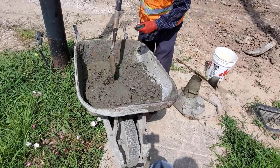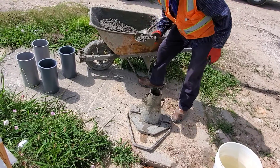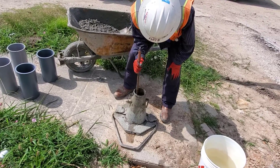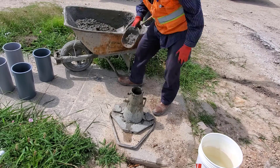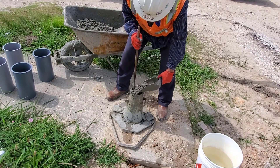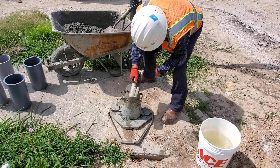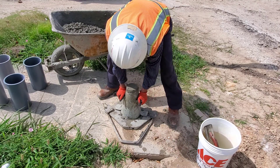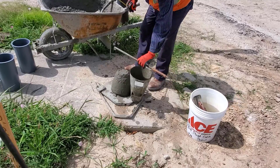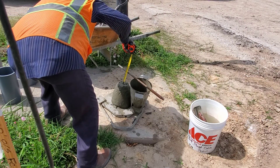The maximum allowable temperature is 95 degrees. He will also perform an air test, a slump test, and make four cylinders for the load breaking test. The slump cone is filled one third of the way and rodded 25 times. Then he adds another one third and rods it 25 times, penetrating the first lift by one inch. Now he adds the last third and again rods it 25 times. He then carefully removes the slump cone in one continuous movement and checks to see how far the concrete has slumped. In this test it fell four inches, confirming the slump is within specs.